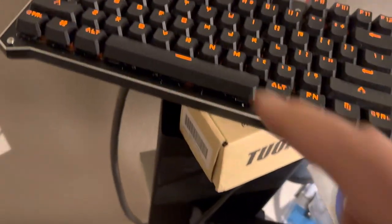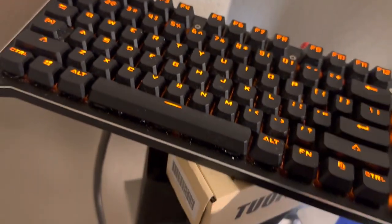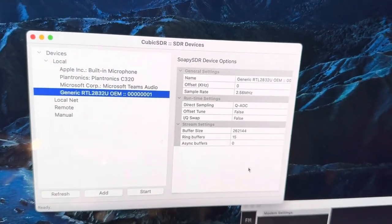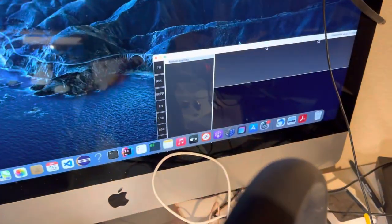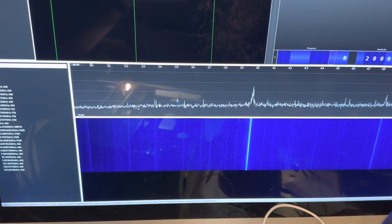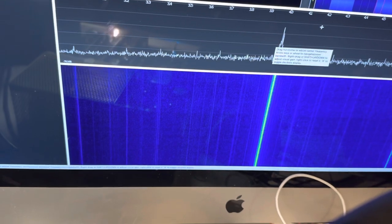I use CubicSDR. Choose this device and I have it in QSDR mode, which you need to receive HF well. Start it up — there it is, maximized. RTL-SDR is running. The PTO runs from 4.9 to 5.5 MHz, so you want to be in that range on your SDR to hear it. I can see something at 4.0 but that's not it. Let's go to 4.9 to 5.5 MHz.